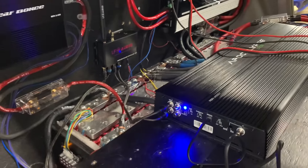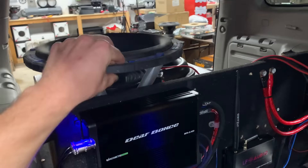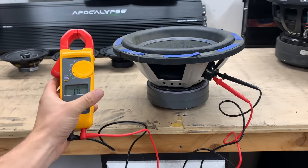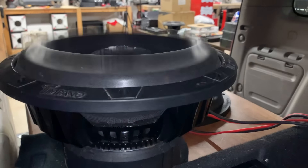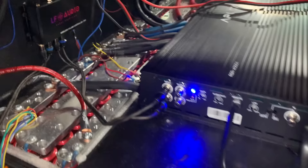When that happens, we'll see if this amp goes into protect correctly and if it makes it through or if it pops the amp. Let's find out. Oh, there it goes — she's blown! Let's get this turned off. This coil totally blew; this other coil still seems to be hanging on, though. The amp didn't make any crazy popping noises or anything, so I'm going to hook another sub up to it just to make sure it's still working. The amp is on and we are not in protect. Yes, sir — the amp is still going.